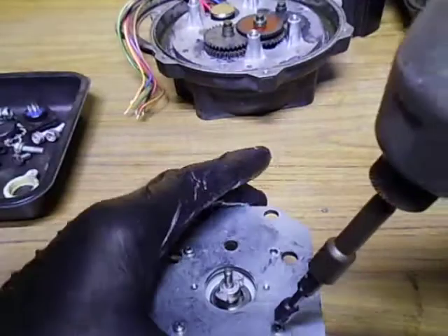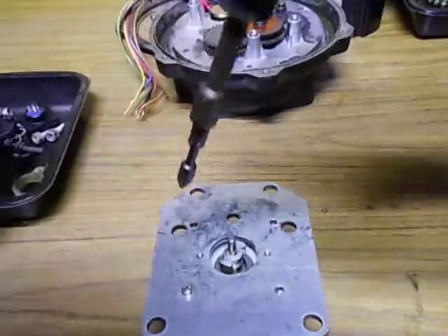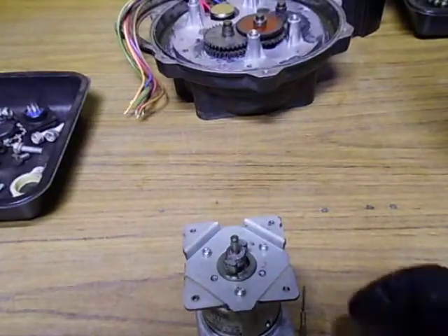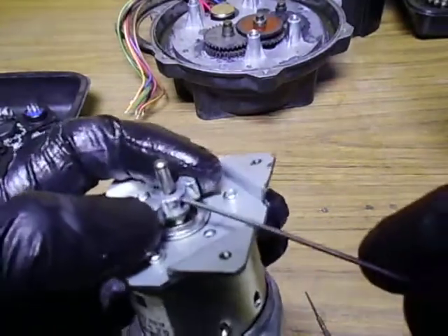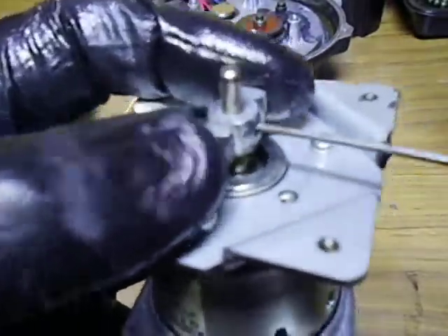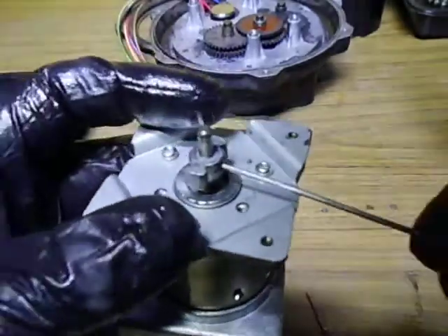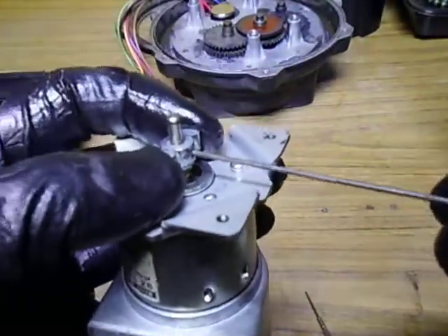I'll get the housing tub off because we need to get it out of the road to realign this anyway. Let's get that out of there. This is just basically a strip down to identify the problem. I'll grab the Allen key - you can see it's just moving up and down, and as you hold the shaft you can see how much it's actually moving backwards and forwards without moving the shaft. So this is what was causing the problem - it was jumping up and down and may have been dislodging from the VK spring. Problem identified.